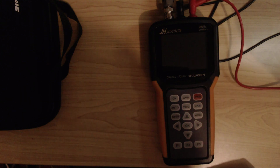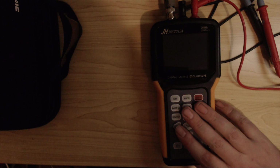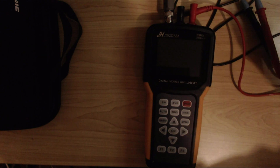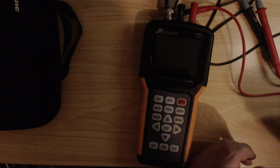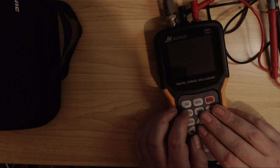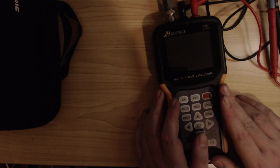So that's not a fault of the unit, that's a fault of the very crappy 60-cent 18650 I have in it, which has already seen a couple of hours use in this device since it was last charged. So that's not too bad. The diode mode, I'm not sure what's going on there. It could just be that the unit's low on voltage, so it's struggling, but it has worked correctly before, even with white LEDs. So yes, it is a 4 volt diode range, but I believe that 4 volts is probably sourced directly from the lithium battery via current limit or such.